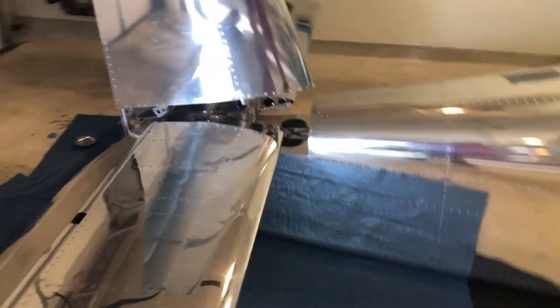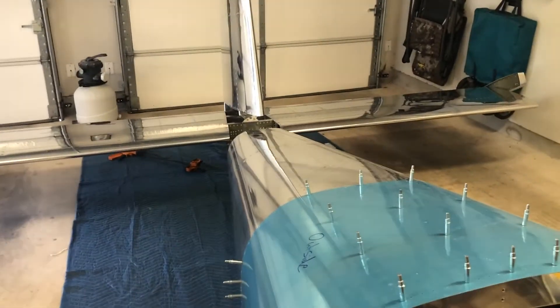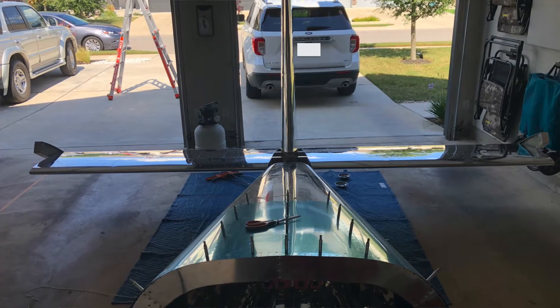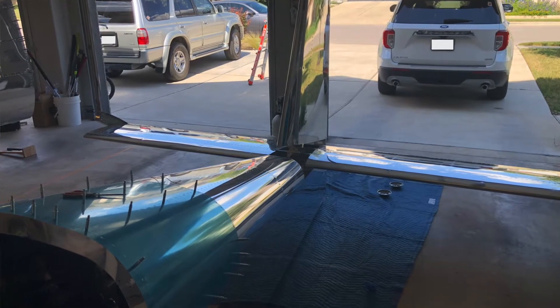But anyway, it's starting to look like an airplane. We double-checked all his alignment on his bolts — they're perfect. We did the string test to check that the horizontal stabilizer is correct from left to right. We checked ground clearances up and down. We checked that the vertical stabilizer is vertical. And there you go — it looks like a real airplane.